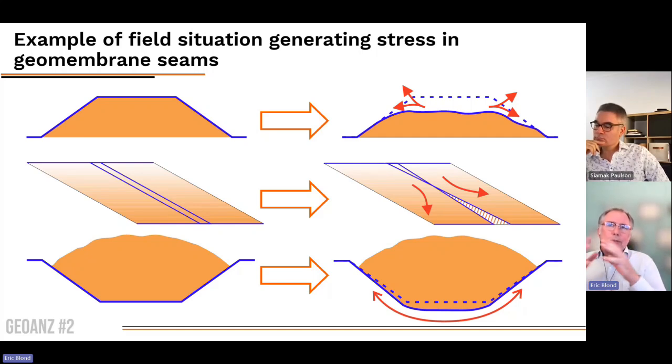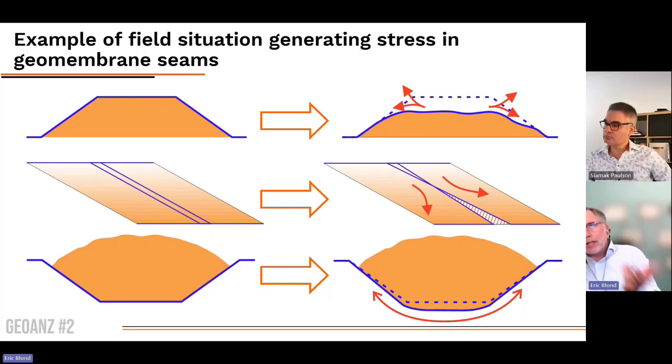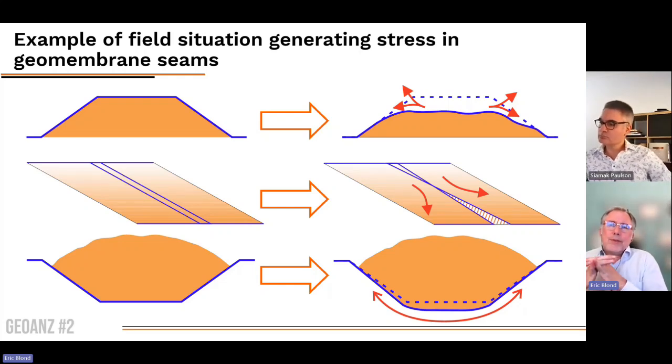In fact, one thing which is very interesting that I realized while researching for this project is that in Canada, you cannot apply a bituminous geomembrane on a roof if the slope of the roof is steeper than 4:1. So if you project that for geotechnical work, a slope of 4:1 would be theoretically okay if we exclude everything else. But if you have a 3:1 or a 2:1 slope in a geotechnical work, the building code of Canada would not recommend using this type of product. So that's one of the tables on the range of applications. That's for roofs.